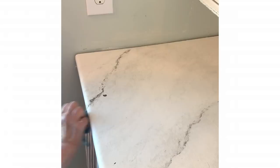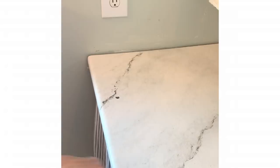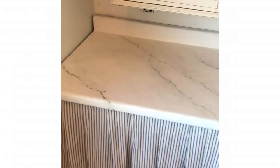We are just marveling at how they designed this stamp and made it so realistic. We have ourselves a marble countertop! We'll let this dry completely overnight — 24 to 48 hours — then we'll put on probably three or four coats of a semi-gloss polycrylic. I chose that option because polycrylic doesn't yellow and it's water-based and easy to work with. We'll come back after we put that final sealer on to see the final result.